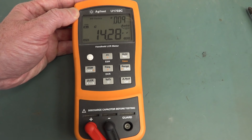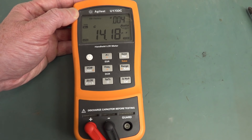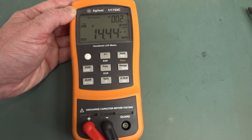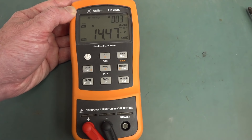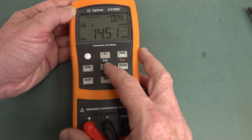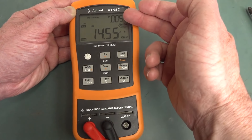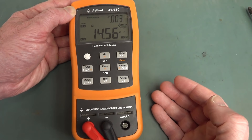Sure, your regular multimeter can measure resistance, and it can kind of sort of do capacitance — it's okay. But rarely will you get a multimeter that'll measure inductance. Multimeters are a fairly crude tool for the job, so an LCR meter does this better with more capability in terms of all the different parameters you can measure. It can measure over different frequencies, different parameters like capacitor quality factor, dissipation factor, equivalent series resistance, and all this sort of stuff.